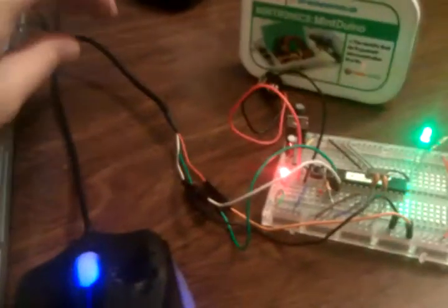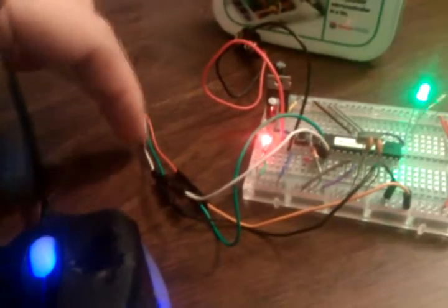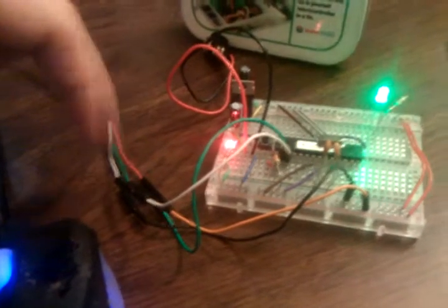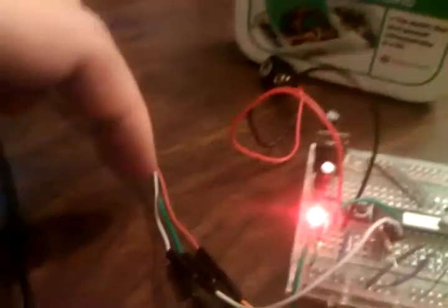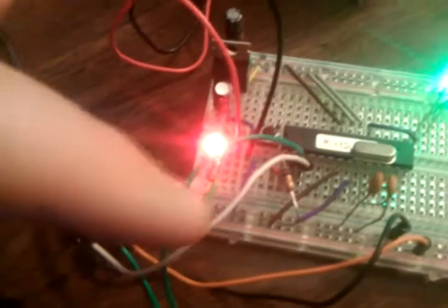So previously I started with a Raspberry Pi. So I have this USB serial cable. This cable is connected over USB to a Windows machine, and it's got the 4 USB out pins. I can never remember what these colors mean. Well, the red is just your power. The black is ground, and then the green apparently is transmit, and the white is receive.